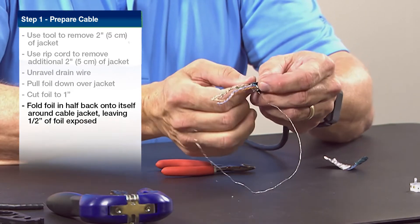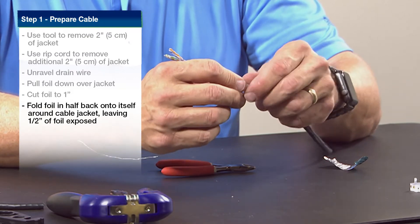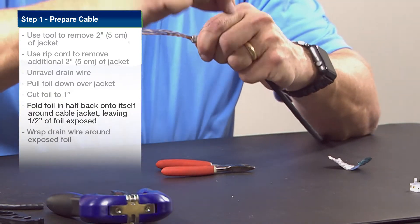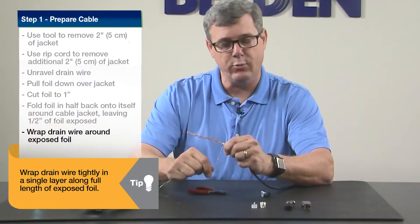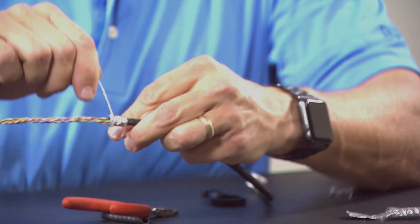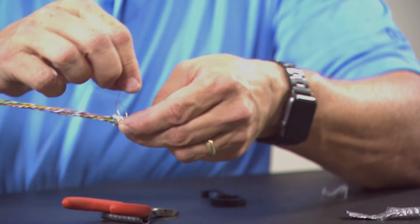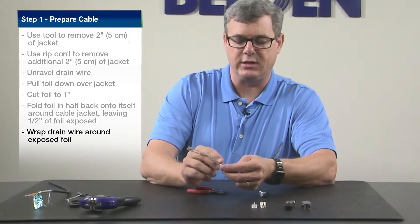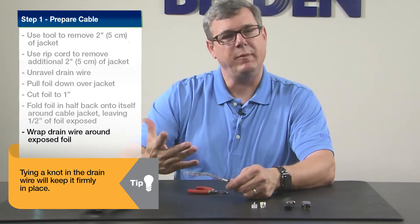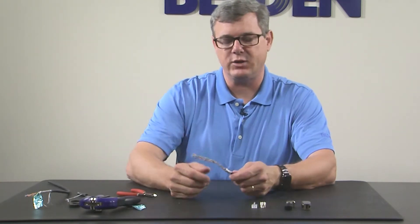We'll fold this back up, so what we end up with is roughly a half inch of foil out onto the cable. We can then fold that back around to the cable. We take the drain wire at this point and wrap it around the cable. We want nice tight wraps in a single layer down the cable, going out that full half inch. At the very end wrap, it helps if you put a small loop and a knot, basically tucking underneath itself to pull up and in — it prevents it from acting like a spring and coming undone. We then snip off the rest of the drain wire and move on to the next process.